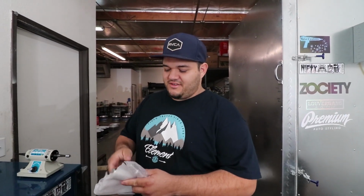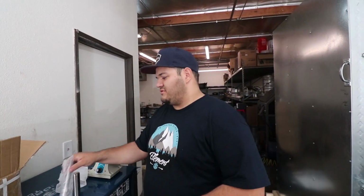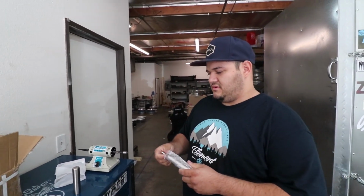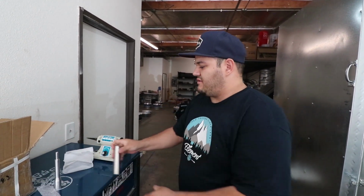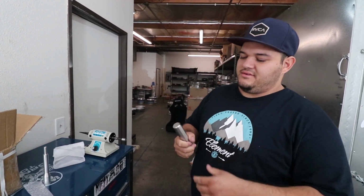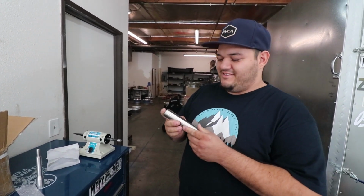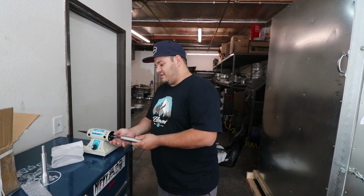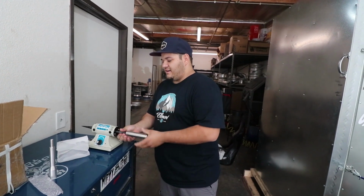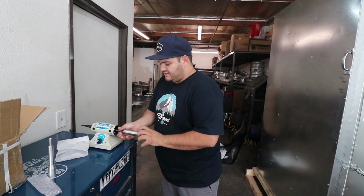So I have our 4-inch knob with the 5-inch extender. So our process: every knob I get in, I always clean up. If it's gonna be candy coated, the China finish isn't that good, so I'll put it on my little lathe and I always give them a better brush finish. That's usually just for candy colors.